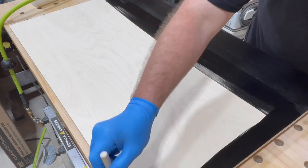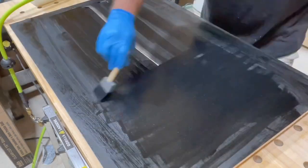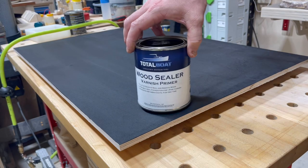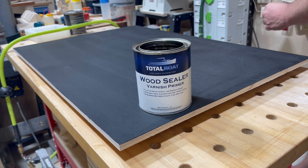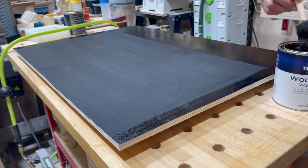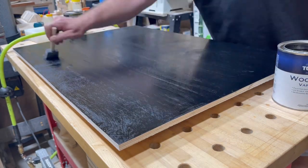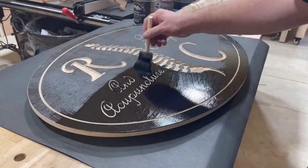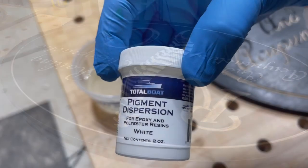Here's a technique I've never tried before - let's hope it works. This next sign is just plywood. I was going to use laminate but didn't have any. So I'm taking some black gel stain and flooding the surface of a piece of half inch plywood. Then I'm going to use that same sealer and flood a coat on here because it's going to go onto the CNC with a V-bit. If you've ever used plywood with a V-bit, you know things can get a little fuzzy, so I'm sealing the wood first really well and then cutting. And of course I forgot to hit record, so there's the result - it actually turned out really great.